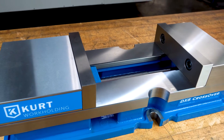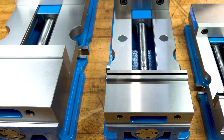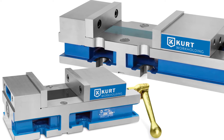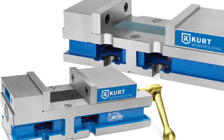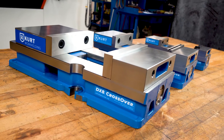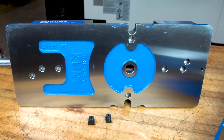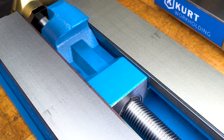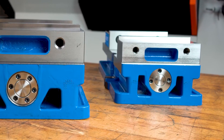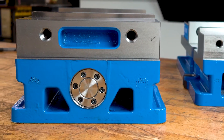The DX series pull type design, including the cast-on stationary jaw, now matches the quality and safety of our highest precision 3600V and 3800V family. The DX8 crossover vise features the same bed height and keyway to the stationary jaw face as the D810, and a redesigned nut with lighter weight and a new brush seal design. The bearing pack is larger, stronger, and more durable than previous designs.